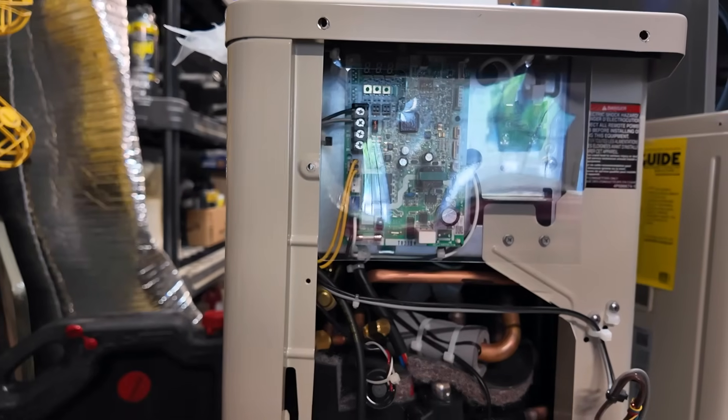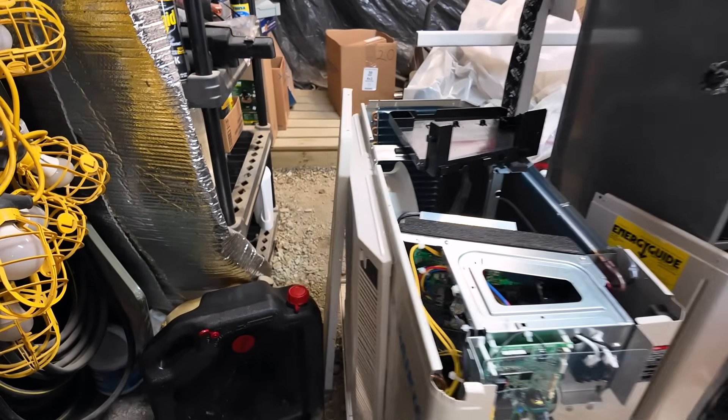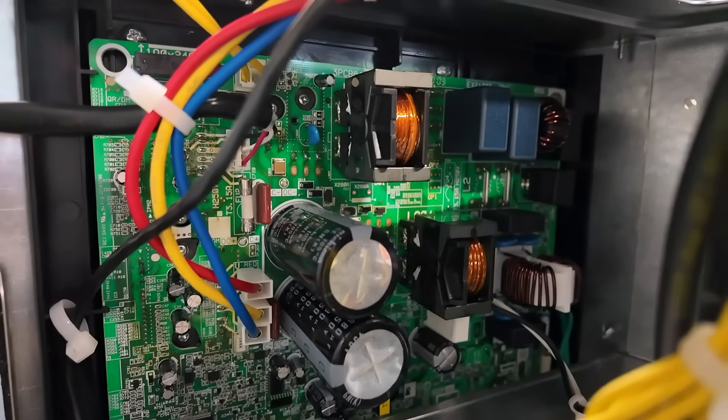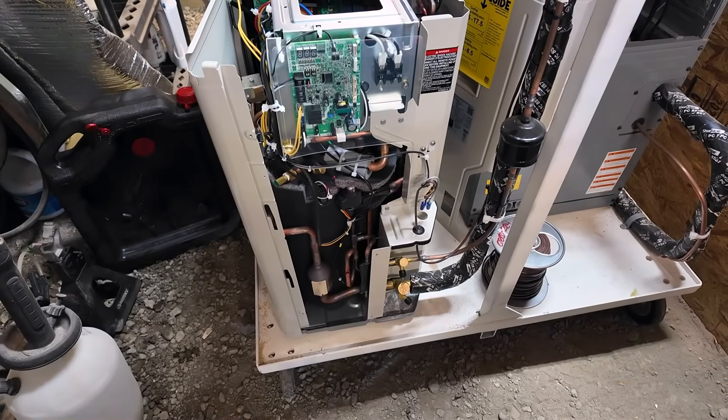There's a very big difference under the hood between this and a 13 SEER single-stage system. I got the top off here — you can actually take the whole front of this unit off to access everything more easily. In the back you can see the second board. Because of all of this, the system can run much quieter and much more efficiently. A single-stage is like a light switch — on or off. A modulating system is like a dimmer switch. But a communicating system is like someone standing at that dimmer switch, constantly raising and lowering it to be as efficient as possible.